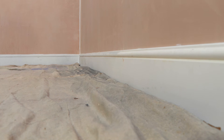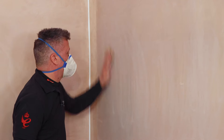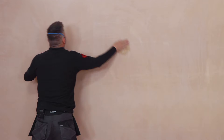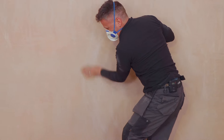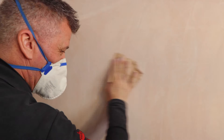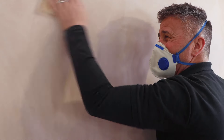Although these are brand new plastered walls, you don't want to paint directly on top of them without a little bit of preparation. I'm using a very light sandpaper, 150 grade, and I'm just gently scoring the surface of the plaster. Because if it's been plastered by a professional, quite often it's like a smooth glass finish, and you want it to be a little bit more coarse for your wall chalk paint to bond into it.